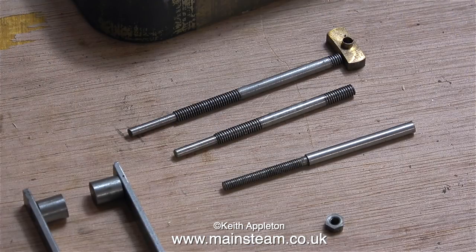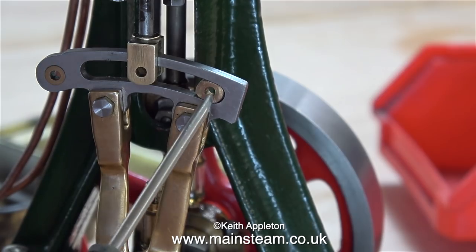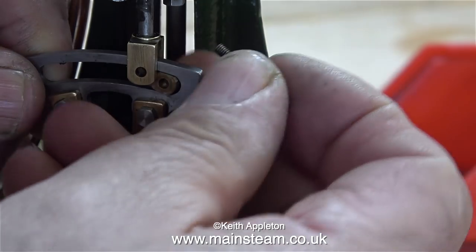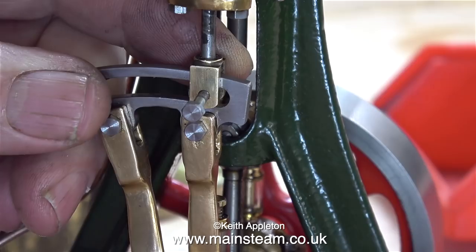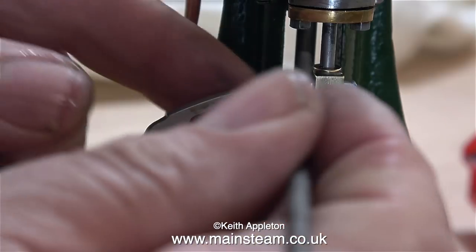In the first episode I showed a collection of parts from the tin, and in the top right of the picture is the basic piece of metal that's going to be trimmed to be the die block. I carefully trimmed it to the right size using my 1-inch belt sander, as it's far too long in its original state. Here you can see it in position once it has been trimmed to size. It's always a good idea to make sure the die block is not too long and doesn't hit the internal part of the expansion link as the expansion link moves across it.